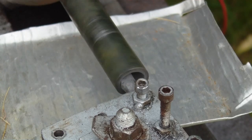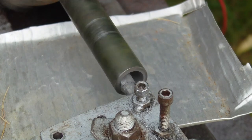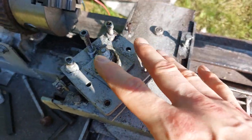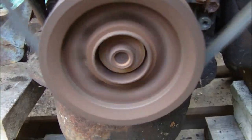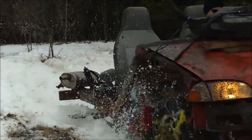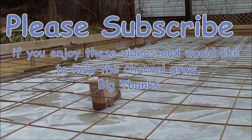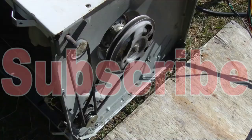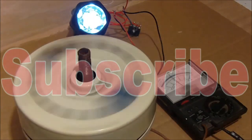I also made a boring tool and was boring out a strut shaft — it was hard as a rock, but a little powder was coming out and it was working. If I use the live center and get the setup more rigid, I might be able to use the carbide. As the channel grows I could invest in better tools — maybe a chop saw — but for right now I have to work with what I have.